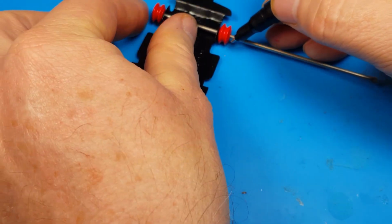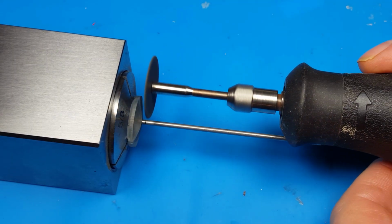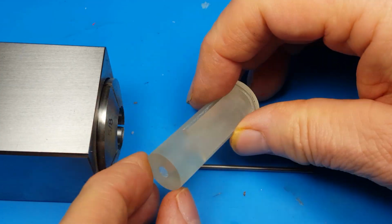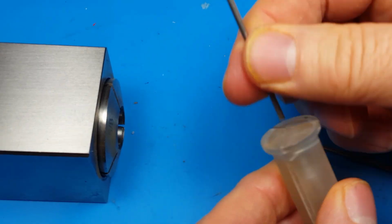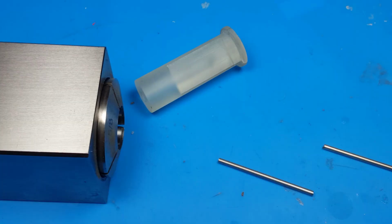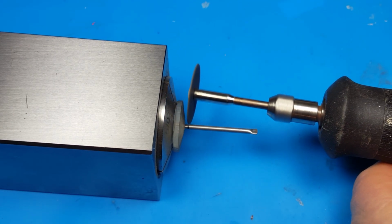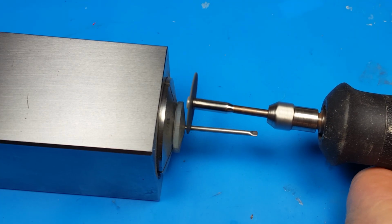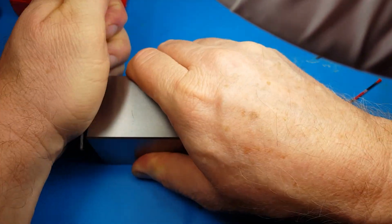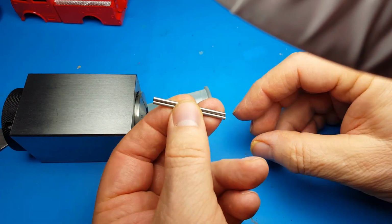And this is my process, if you haven't already seen it, for making axles. This is 2mm stainless steel tubing, and I cut them to length, and then clean up the ends because the Dremel tool leaves sharp edges and stuff. And then to mushroom the ends, I actually have little nails that are shaped just like Dinky toy mushrooms, and they fit into the hole in the middle of this tubing. I call it tubing because there's pipe and there's tubing, and what's the difference between them? Tubing is measured by the outside diameter, pipe is measured by the inside diameter.